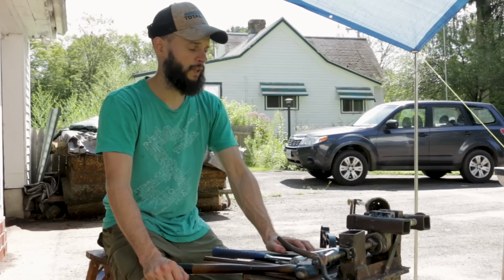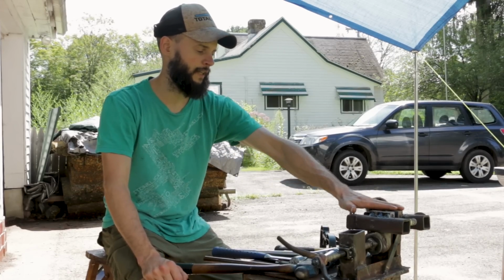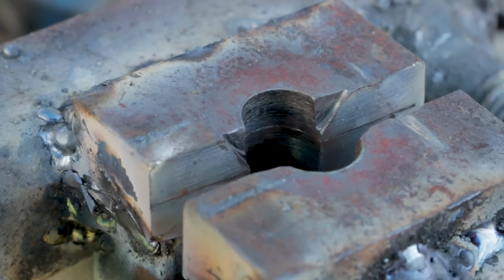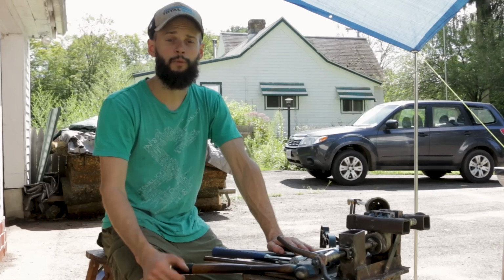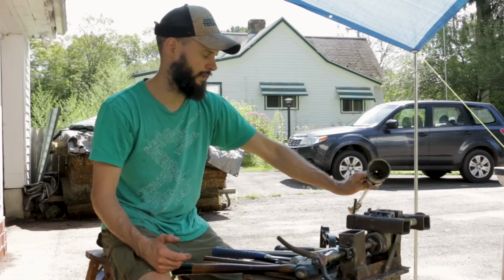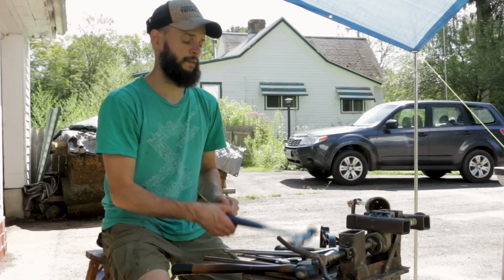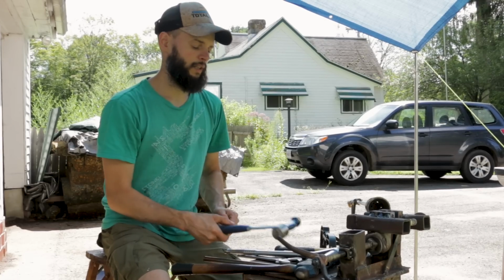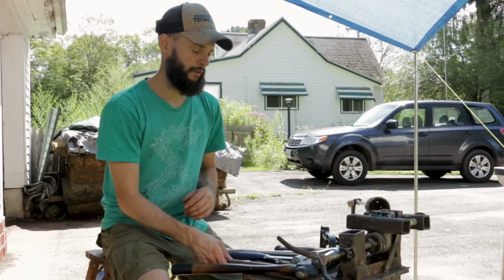We tried that with the propane weeder and the acetylene torch, and we couldn't really get the fins to form. So what we ended up doing was filling in the countersink and going to a die that was flat across the top with just 2 little fins cut out to form the fins. And with preheating the die with the propane, and then heating the head with the acetylene and beating it with a ball peen hammer, we found that we could get the heads formed pretty well and get the fins formed pretty well. And now we're up and running.